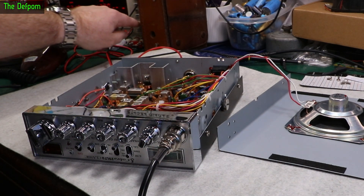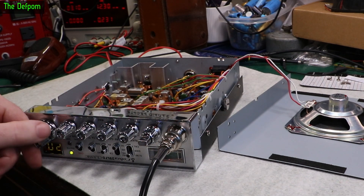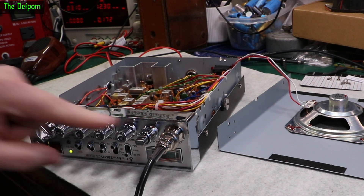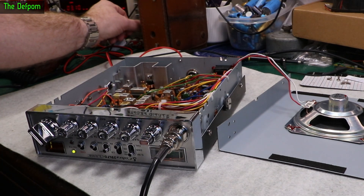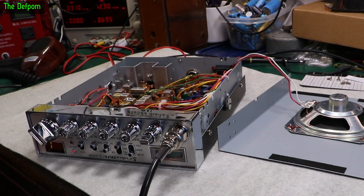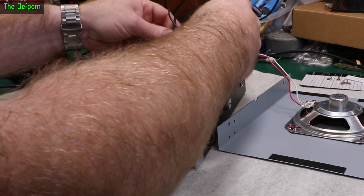Let's turn this on. We've got channels — that's all looking normal. I've already preset the controls. Still transmit on that. Yep, it's transmitting fine. I'm going to be over-current limiting my house supply here because I've not got it set up right. Let's just fix that. Only got one amp out, so that's fine. Let me quit my scope and just check the frequency output, make sure it looks about right — just for reference sake. Yep, 26965, that's all looking fine. It appears to be working all right.